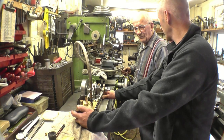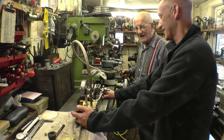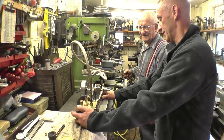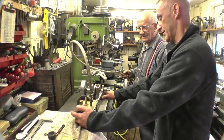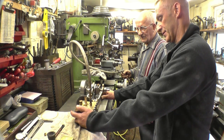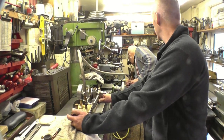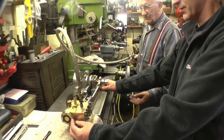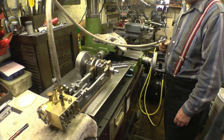So if you want to rig an airline up into Deb's boudoir so that she can show it running for a display, you can rig her up with a ten-pound airline and she'll be quite safe. That's really the test of valve setting — how long they'll keep going on very low pressure and keep running evenly. You can see it's running fairly evenly — it's not bad at all. It could be worse. That now is running off nothing — that's running off less than five pounds, on about three or four pounds. It will, of course, eventually stop.